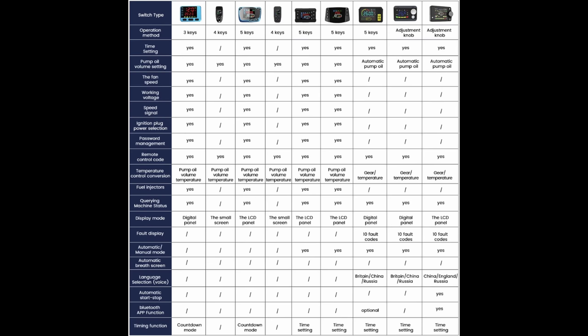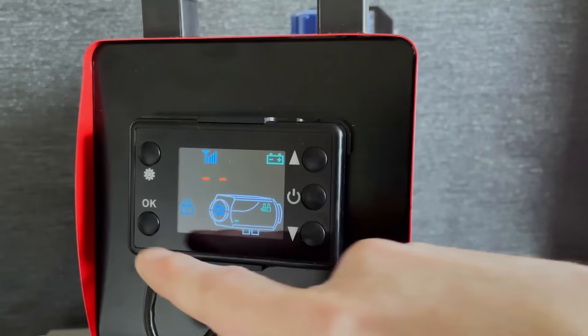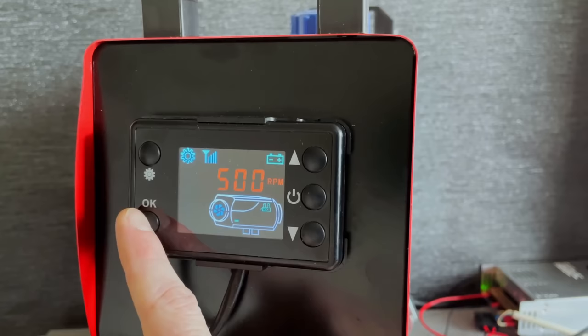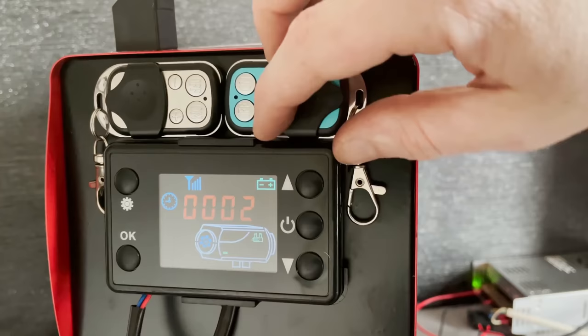The hidden menu is very important on this motherboard and controller. They don't automatically sense your altitude like some of the newer controllers, so if you live at high altitude or are travelling at one you will need to get in and change your fan and pump speed to adjust the air fuel ratio due to the reduced oxygen. Anything above 1500m would need manual adjustment. Links in the description.